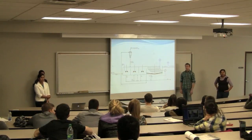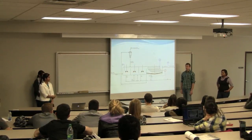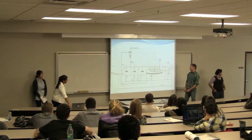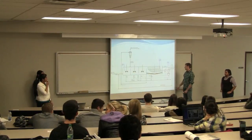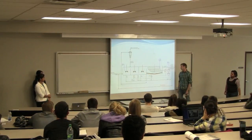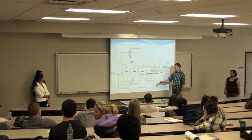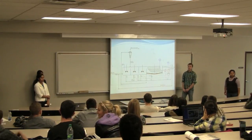Do we have a sense of how much turbidity relates to polymer and sand flows? Yeah. So our solution was pretty much that. A turbidity controller on the outlet pipe, but also hooked up to a three-way solenoid valve, which will open if the turbidity is too high and bring the outlet back to the inlet. And the controller is also hooked up to the polymer and microsand inlet, so it would increase that as well. Any questions?